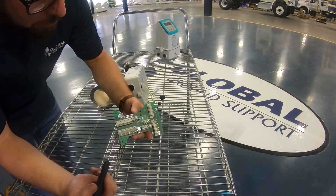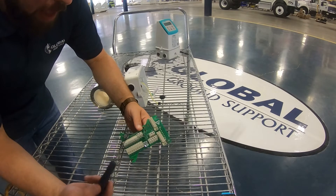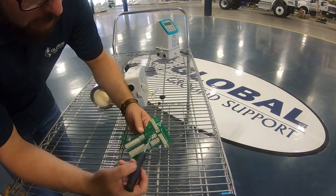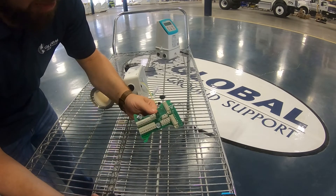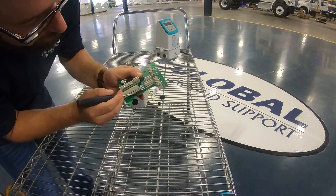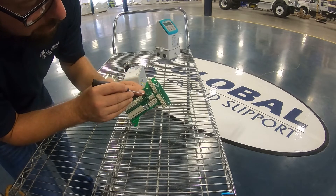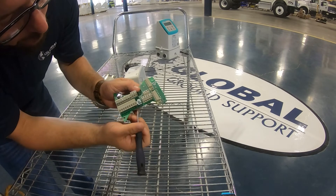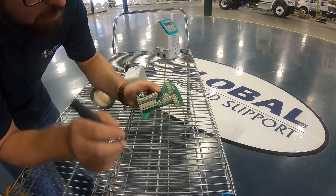Another important piece is how this is actually wired. A lot of the time it isn't wired correctly and it just won't send a signal out. A lot of people think that since the screen on the transmitter head has power, it's going to send a signal out. In reality, for our application, if terminal 56 doesn't have power the sensor won't have power. Usually we have a jumper that goes from 12 volts, typically running under the board and around terminal 56. This is what powers our external sensor to send a signal to wherever we want it to go.